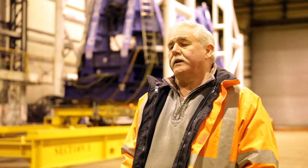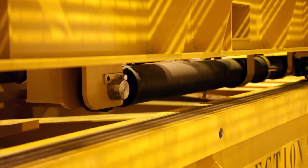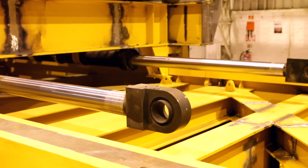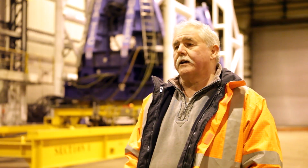The trolley is mounted on top of the skid rails and is mounted on four sets of Hillman rollers — 200-ton rollers. The skid is translated by two Bradford cylinders, which are very high capacity hydraulic cylinders that extend and drive the trolley down the deck.